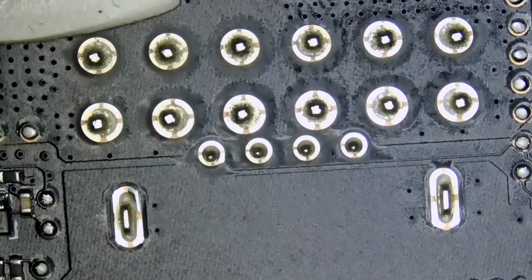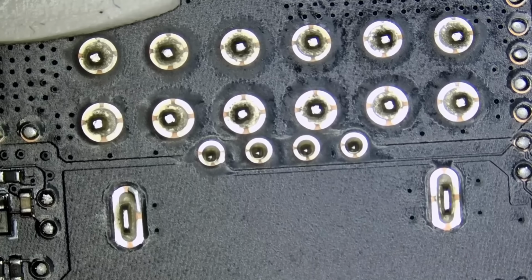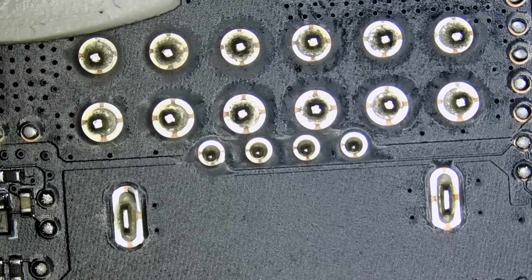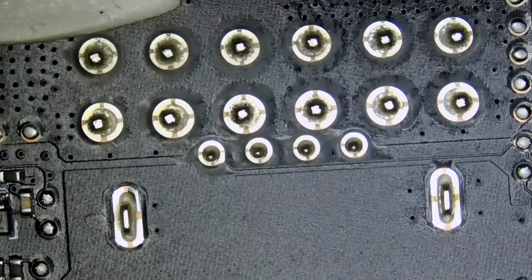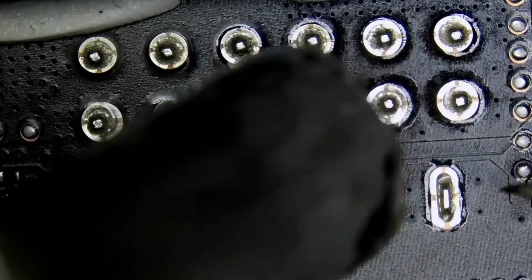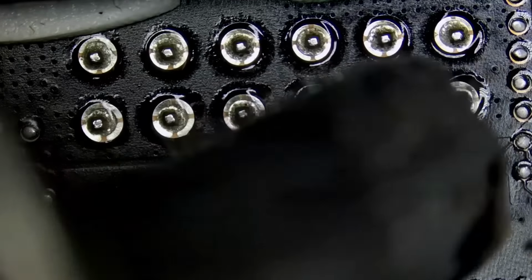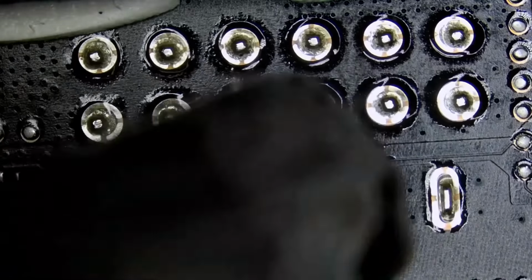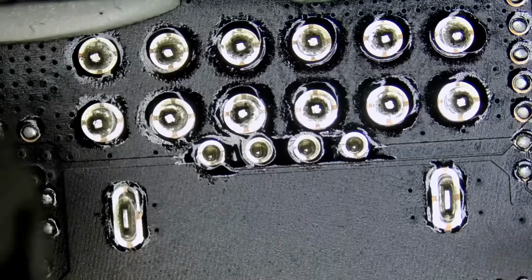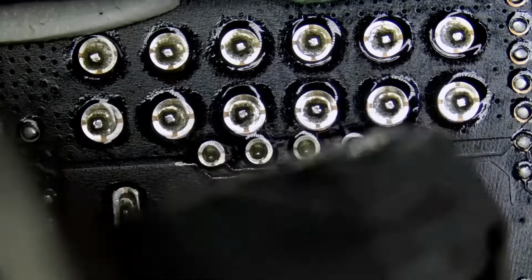Right now we're gonna start by preheating the board. Let me turn the fume extractor on. So like I said, you either break the connector or you melt the connector. If you do not plug in the cable all the way, the connector is gonna melt and burn. And if you force the cable all the way in, the connector is gonna break. Great.